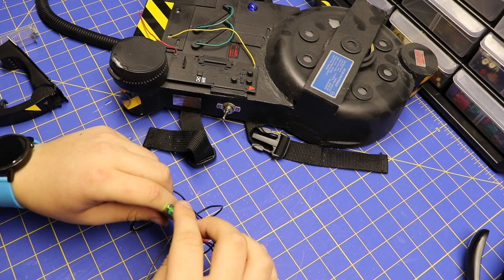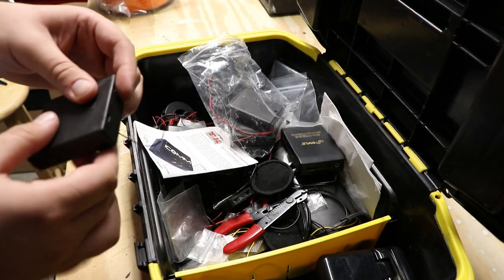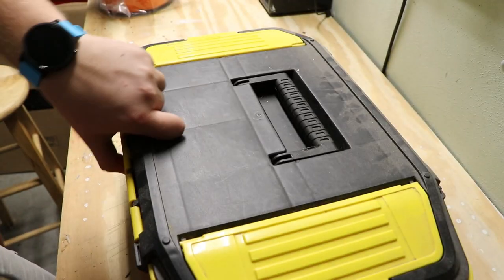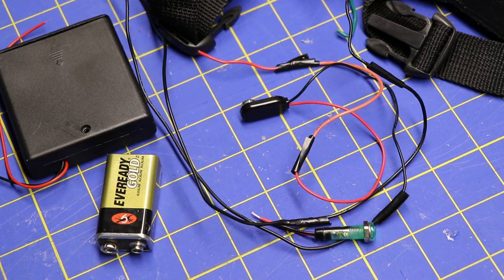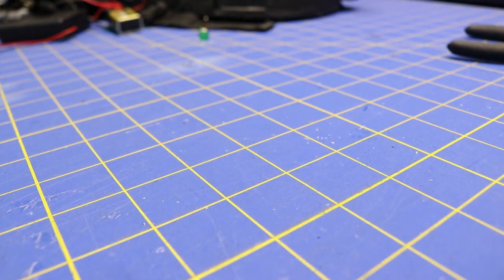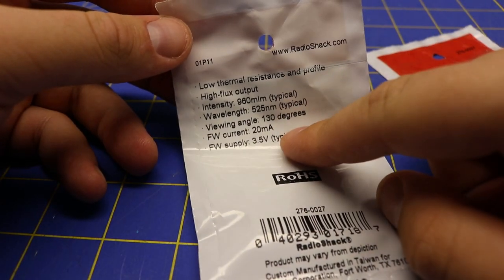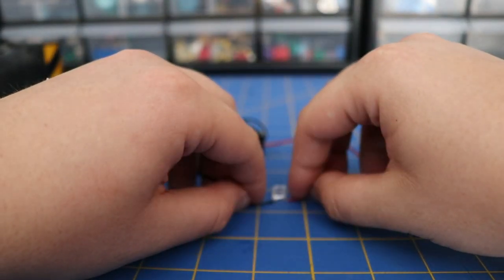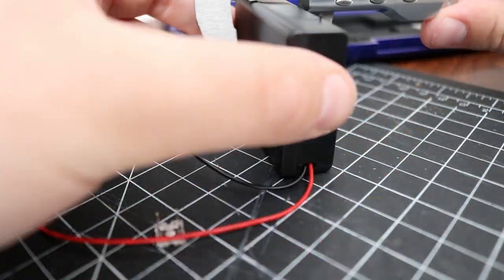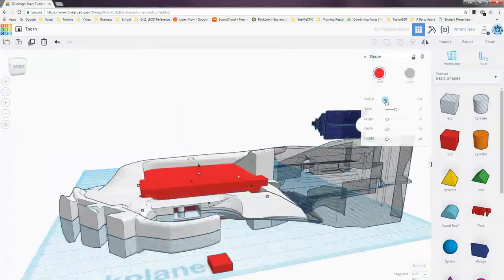I did some tests and decided the light was really, really dull. My dumb brain didn't do the math — I thought if I took the 9-volt battery off and plugged in a battery pack of double-A's it would be brighter. That was not the case. So instead I went to the local electronics store and picked up a four-pin bright LED that was green — 3.5 volts, 4 volts max. When you combine three double-A batteries it ends up being 4.5 volts, which was perfect. From there I just had to measure the battery pack and LED and open up the 3D model file by Kirby Downey.